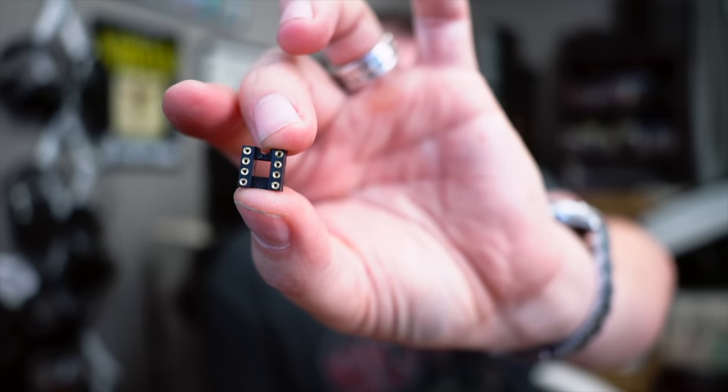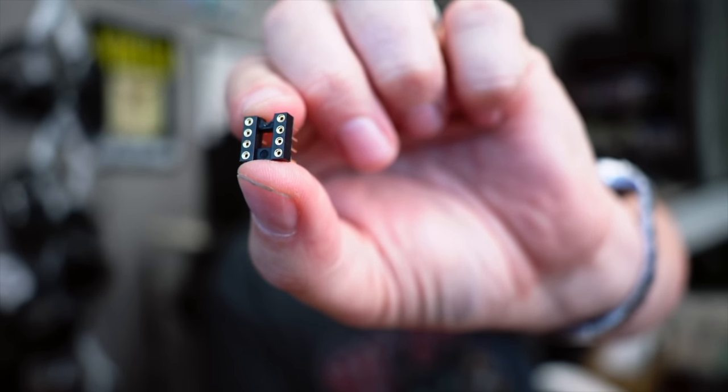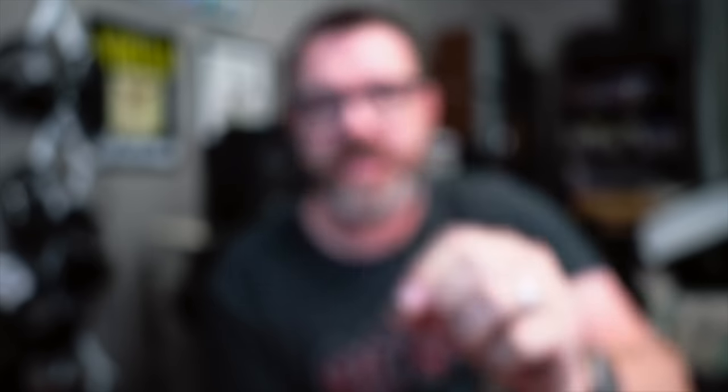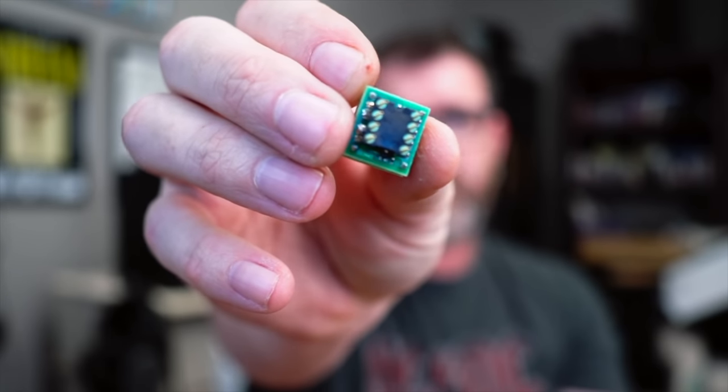This is an op amp receiver. There are eight pins and there's a little notch. That notch at the top tells you how the op amp should be oriented, because if you put it in backwards, bad things are going to happen — it's not going to work and it's going to fry your op amp. So you have to make sure you line up these notches together. If you look at the bottom of the Sparkos, you'll see it has a notch right there, and you just line the notches up.